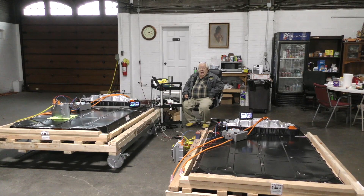I gave him Sandy's email address and he went ahead and bought a 50 kilowatt unit from them. Sandy will build in the frequency shift fairly easily, and that allows us to shift the frequency from 60 hertz to 62.5 hertz for 500 milliseconds to shut down an Enphase or SolarEdge or any other UL 1741 compliant grid-interactive inverter or micro-inverter — which we need to be able to do if the batteries get full. But I really don't want to be in the middle of a $15,000–$20,000 transaction that may arrive damaged.